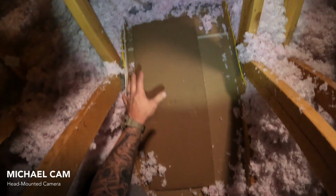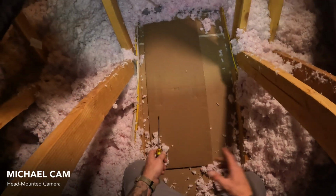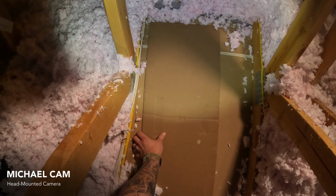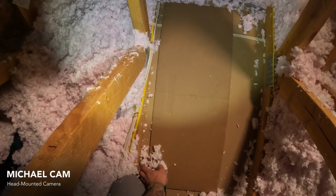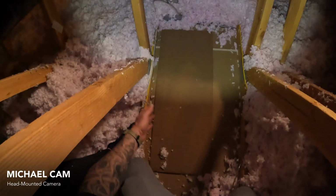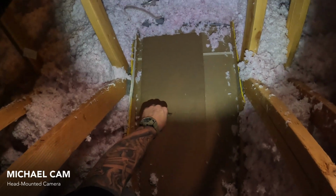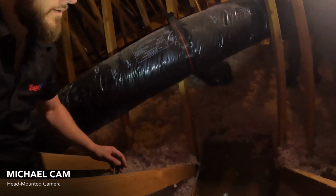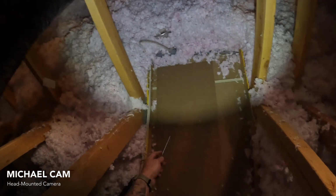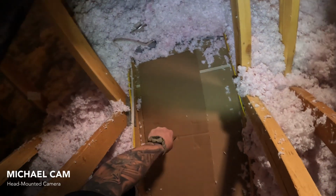So I'm visualizing the hall downstairs. Okay. Our damper boxes have plaster grounds on either side. So I'm going to come off the truss just enough so that plaster ground can have enough space between the truss and my cutout. Being that I'm not going against the truss, on this one I'm only going to mark center. All right? Because we know home builders, they're not always perfect, right? We don't know if these are straight and true. I'm not going to rely on this being square, so I'm only going to mark center on this one.